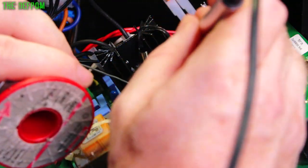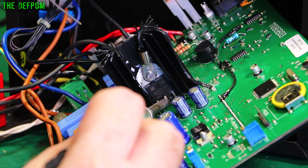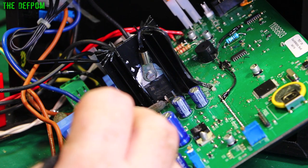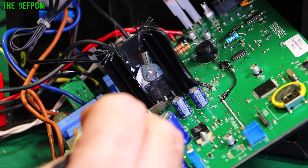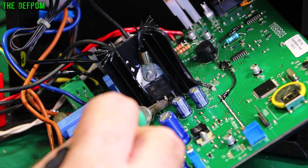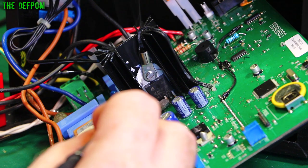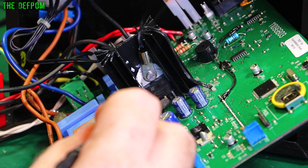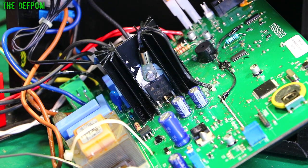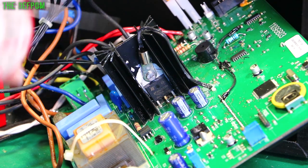You can see the middle leg's not soldered too well there, so I'm going to solder from this side too. I'm probably going to be in the way so you can't see much anyway. Because it's got conformal coating all over the place, that really doesn't help. Big thermal mass, conformal coating, really small tip. It's not flowing on top of the pad very well - I want it to flow onto the track. The conformal coating's in the way. I got in here with some tweezers and just gave the conformal coating a scrape in the area to get rid of it, and I got that sorted out. The other two legs look fine, but just that middle leg was a pain. So that's that one soldered.